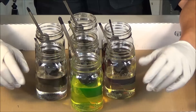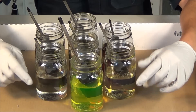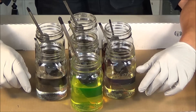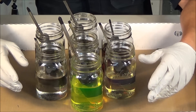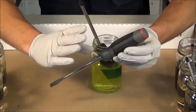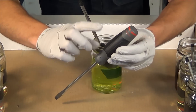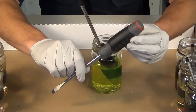It's now 1:30 p.m. on the following day, so it's technically been just a little longer than 24 hours. We're going to take a look at each one of these now to see if there's been any problems with the handles deteriorating after sitting in these fluids. We're looking for damage regarding separation of the different layers, swelling, as well as discoloration. Here is our control screwdriver — this was not exposed to any chemicals at all, and this is what I'm going to be comparing each handle to.